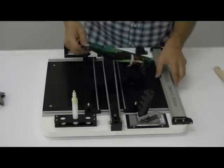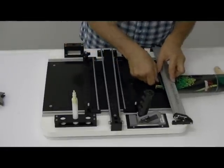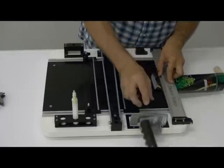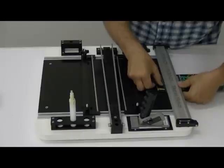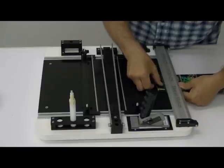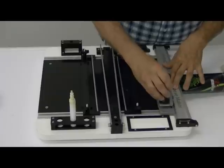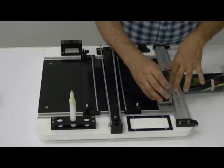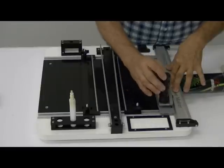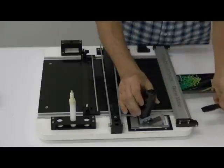The next thing I'm going to do is cut the sample. In order to cut it, I'm going to raise the clamp, slide the material under it, gently push down on the edges, and I'm going to align the edge of my copy here with the engraved line that's in the bed of the machine. If I line it up properly, I'll end up with a two millimeter clear area after I make my cut. I then push down on the clamp, put my cutter in the slot — the cutter is spring loaded. I'll gently push down and slide forward, and it cleanly cuts one edge.